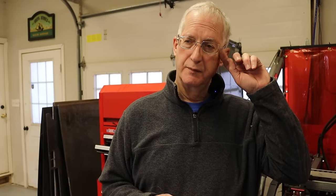There's lots of suppliers out there for CNC plasma tables and a lot of videos on how to build one of your own. It's not rocket science, but I've been happy with the Langmuir systems. This plasma table, just FYI, I think is now $2,700 or $2,800. And there are some options you want to get for it, like the torch height control, which controls the height of the torch as it's cutting and adjusts it as necessary. So I think that's a valuable accessory to have. And the machine torch, like I said, a machine torch. So with those options, I think it's probably $3,500 or something like that. So not ridiculous. It's a nicely built machine, so I have no complaints about that.